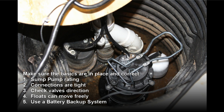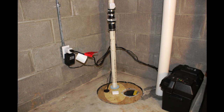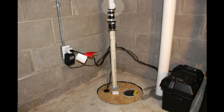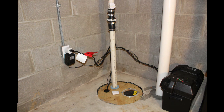Nothing needs to be disassembled or removed from the sump to install and use these sensors. The water leak sensor is located on the sump pump cover. The multi sensor is cable tied to the pipe just above the check valve, and the smart outlet just goes in the outlet for the main sump pump and is only for those interested in monitoring electrical draw from the main pump.